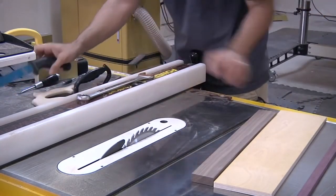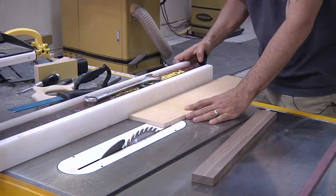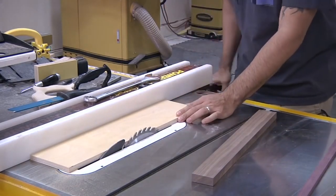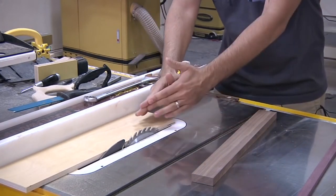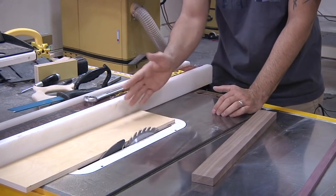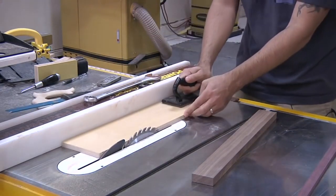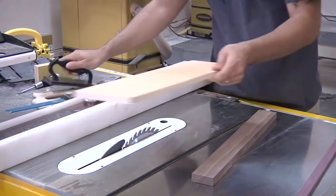First, let's start with this nice wide piece of ply. By the time you're making this cut, you can use your hand, but it gets a little close. Anytime we can keep our fingers away from the blade, the further away the safer it's going to be—that's the bottom line. Using a push paddle is certainly one option, and it's not too bad for this particular situation.